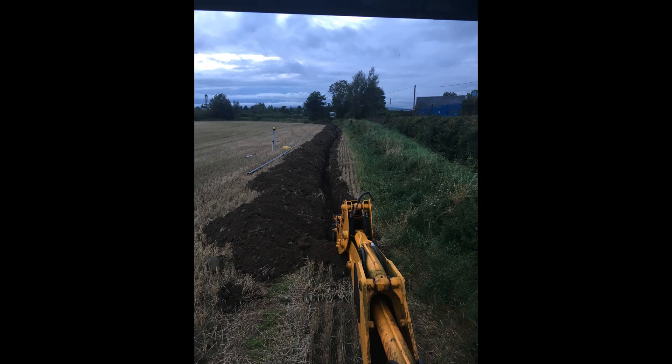It is also advisable to work with the laser level when excavating your pipe trenches to keep a close check on your levels, especially on your waste water outlet, to make sure the waste water is not impeded and can cleanly get away.